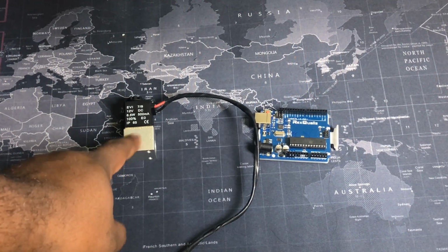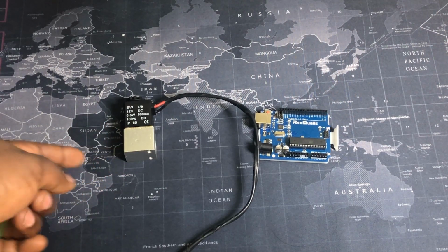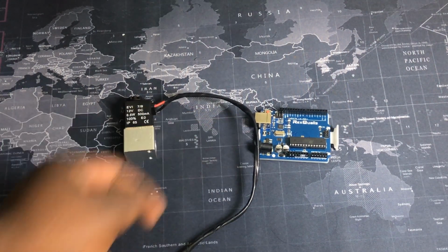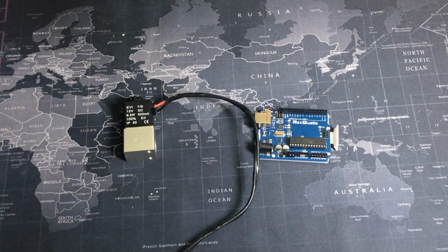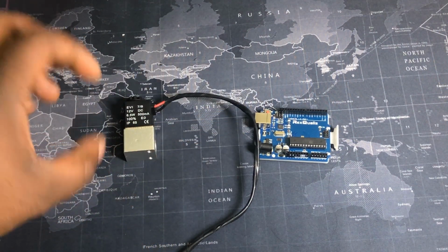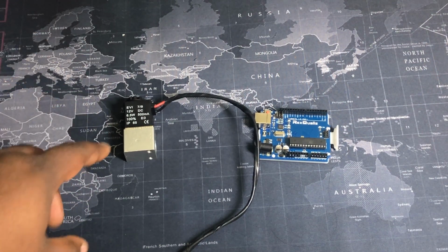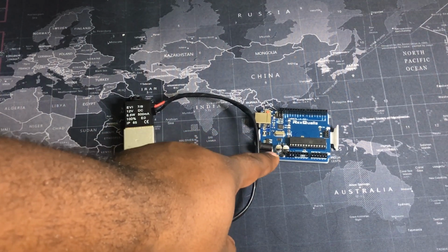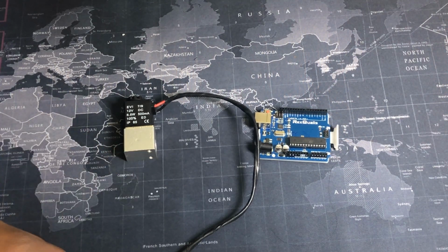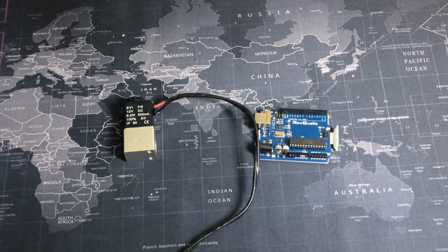But when 12 volts is not applied to this, or ground is turned off from this, then this becomes normally closed. And air will come from the engine and hit here, and it'll basically be capped. That won't send a vacuum source to the blow-off valve, and it won't send a pressure source to the blow-off valve. And your blow-off valve will stop working. It'll still hold pressure, but you're not going to get that venting whoosh noise or whistle noise. So now I reprogram this in the code to control this, depending on where I move my joystick and which mode I put the car in, to give me the instant gratification of having a blow-off valve to not having a blow-off valve. The best of both worlds.